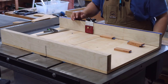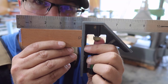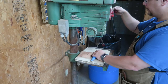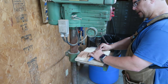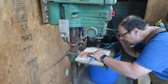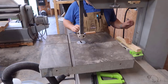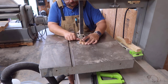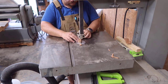Let's square this up so we can have a reference base. Now let's drill the holes for the pins. I'm using a one-eighth-inch drill bit right now, but we'll see later — it's not the right one, it's a bit too tight. I'm going to switch to four millimeter instead, to avoid the wood cracking, which we'll see in a minute. Let's now shape roughly the contour of the handle with a bandsaw — you can do that by hand too, but it's a lot longer. Just be careful of your fingers.